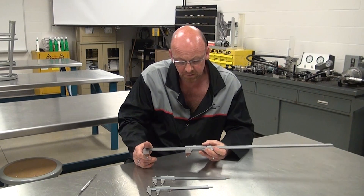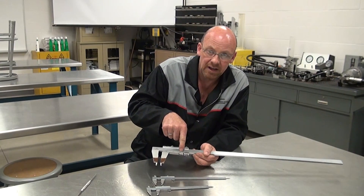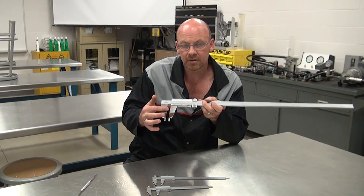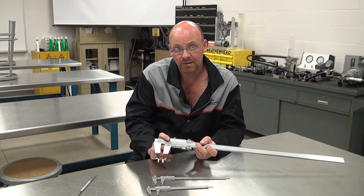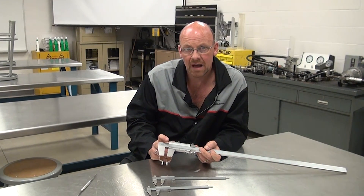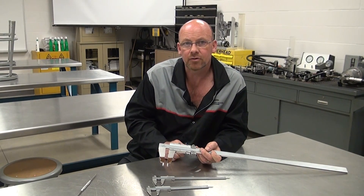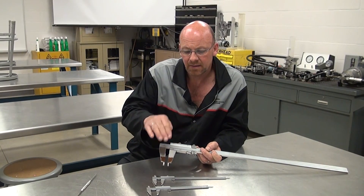The scale on this large caliper is in imperial measurement only, with an outside scale reading and an inside scale reading. Because the jaws are different dimensional sizes, the increments start at a different point. Since it's designed for tight tolerances on bearings, instead of reading in 0 to 25 thou increments, this one reads in 0 to 50 thousandths of an inch, allowing it to be broken down into 0 to 25 thou increments for greater accuracy.